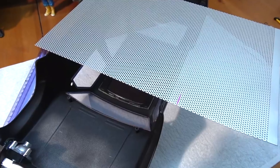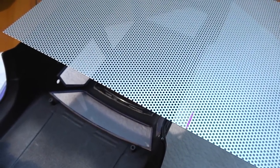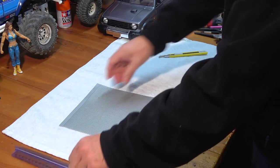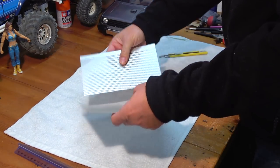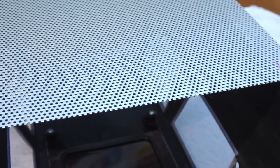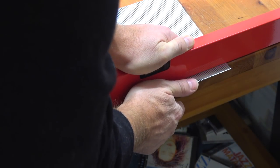First, I have to bring the aluminum plate to the right size. I mark the correct width and use a cutter to carve a line into the aluminum. Now, when I bend the plate, it will break exactly along the line. Now I mark on each side the positions where I have to bend the edges and make some flaps. Carefully I bend it over the edge of my working bench.